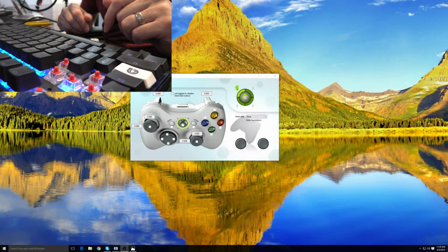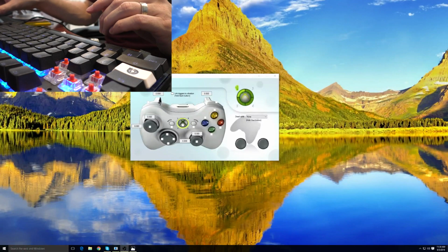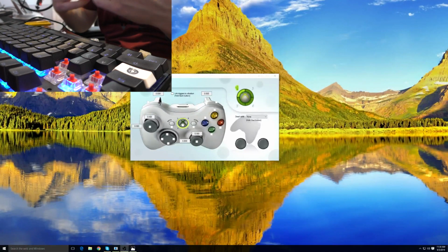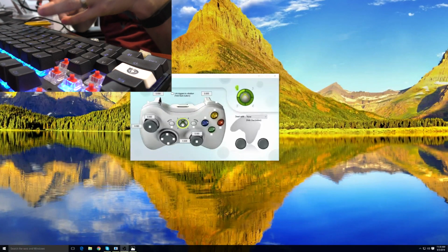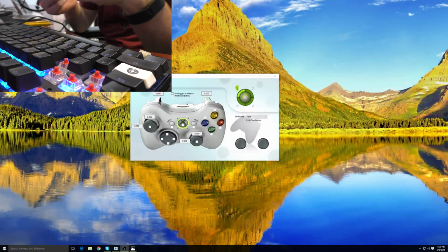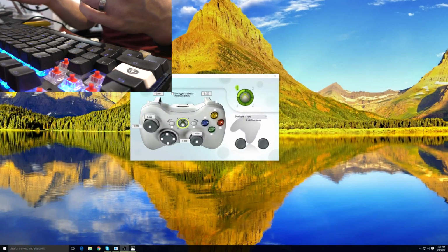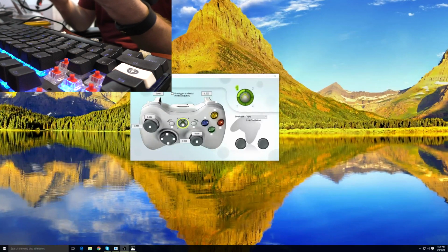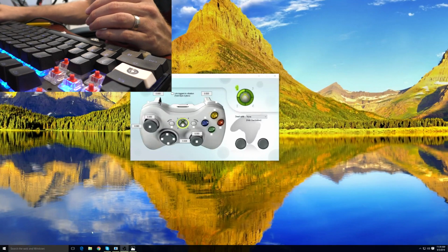The reason for that is I basically have tested all these different types of switches, all these different things about them, and the biggest impact on the effectiveness of a switch is actually the color, simply because we're using the stem itself to generate this analog signal. So that color is actually absorbing a certain amount of infrared light, and that's causing some problems with different types of colors that you use.